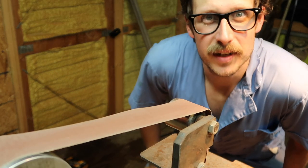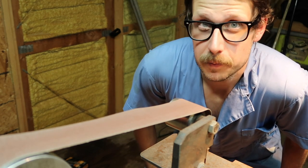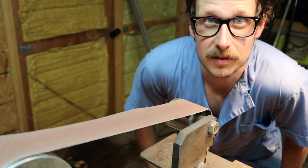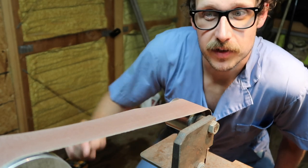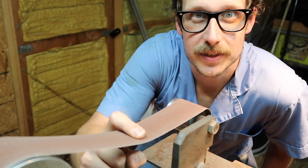I'll probably switch to a 400-grit, so I can go really slow and make it nice and smooth. I've got my 400 on here — this is actually a J-weight belt, which means it's very flexible. The other belts, 60 and 120, those orange blaze belts have a very stiff backing. J-weight belts are very soft and great for contouring and smoothing things out. I put some slack in the belt, force it down, and the belt actually contours and makes a very nice radius.